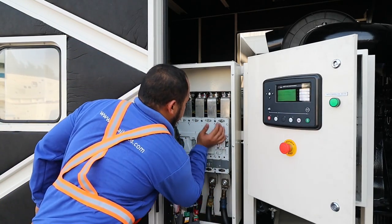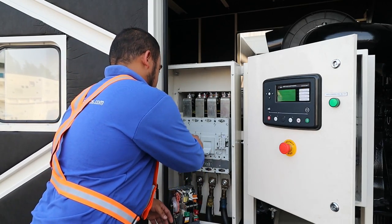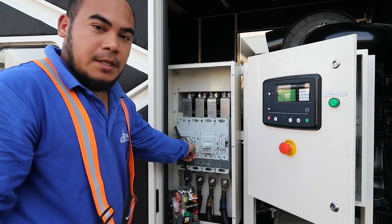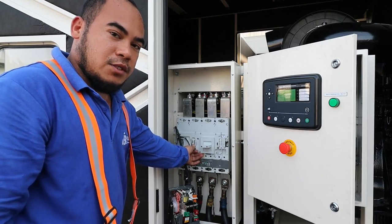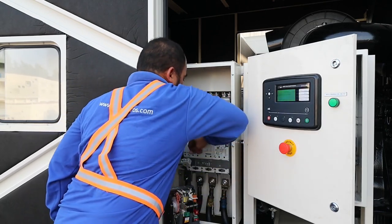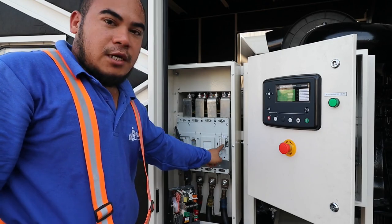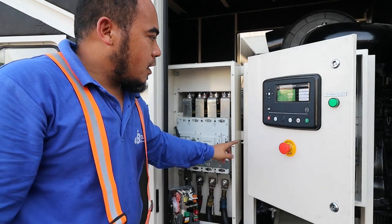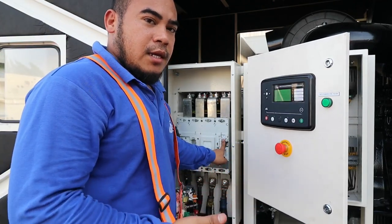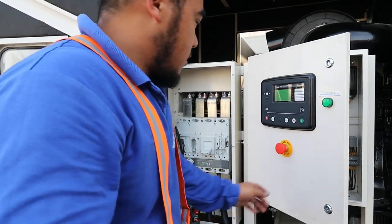I will try to put the breaker up — now you can turn it on and off. If I put this solenoid in, it will trip the breaker because there is no supply and our generator is in stop mode. So if I remove this solenoid I can turn it on and off. We remove this solenoid at the trip point in order to check our auxiliary contact, because this is the one that gives feedback to our module so you can tell if the breaker is closing. Now we will check why our breaker is failed to close.